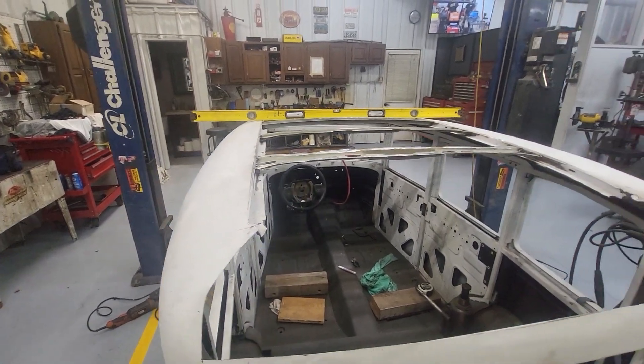I'll sure have to hit them again, but at least at this point I've got a nice sharp line. You can see here where there's a seam — that's a lead seam, that's where it was arc welded together in the factory. I've got two layers here — this is kitty hair or strand-reinforced fiberglass on the bottom. The lead was pretty well ground out. Up here I came in and re-welded this because we had a tear in this one.